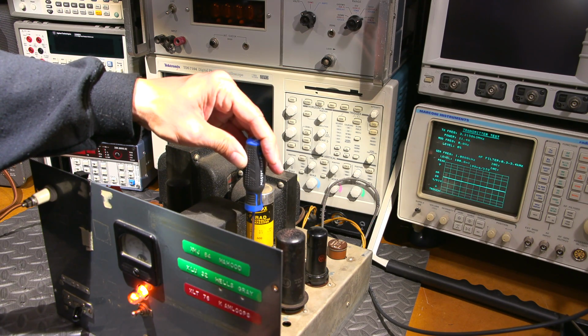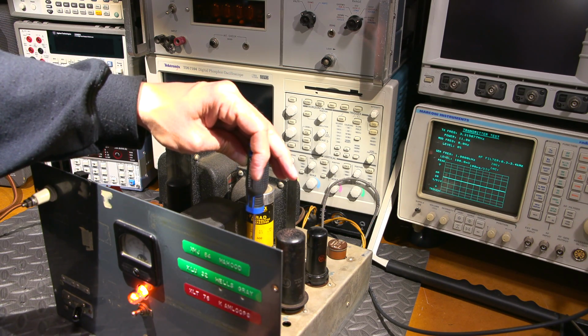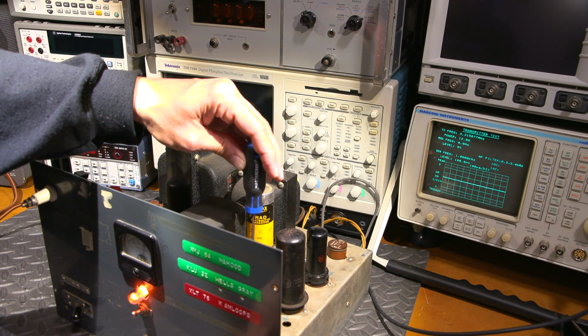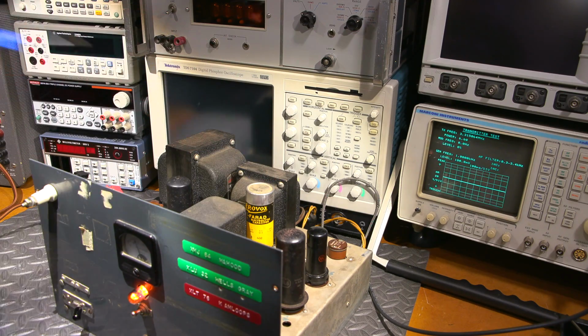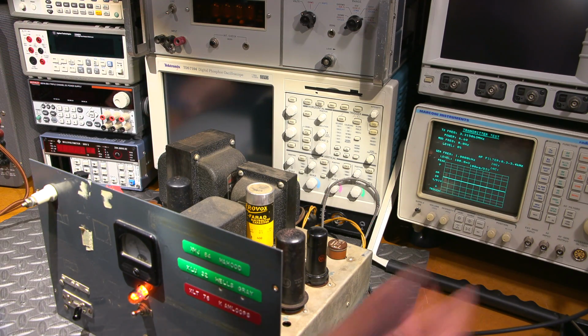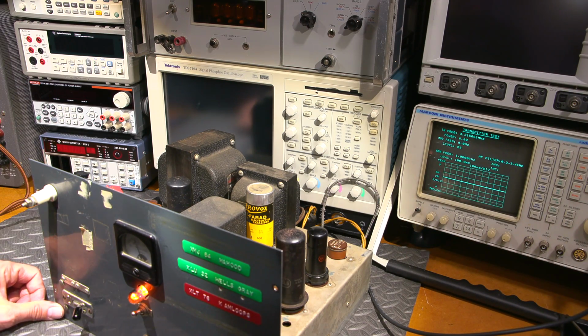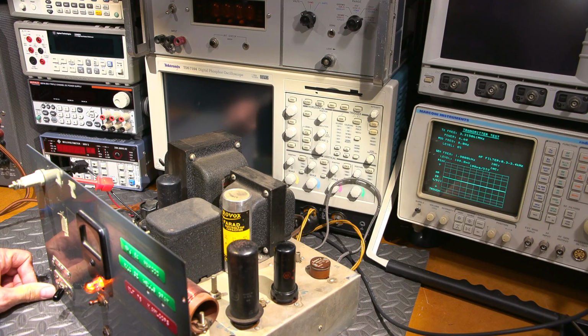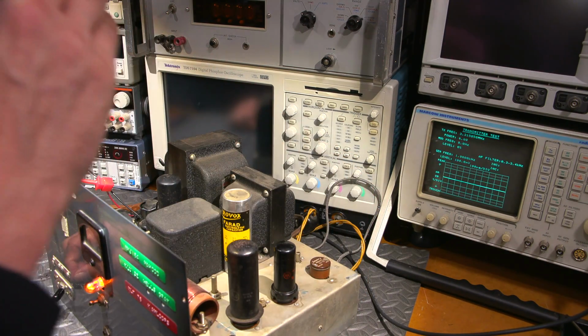I'll bring this out of the dip, and let's move this around just a touch. Yeah, out of the dip, we can get about 12 watts. It's flickering about 12 watts completely with that one old 6L6 there. So I'll just leave it there. Not much of a difference. Again, it's into a non-inductive load, right? So, with my slight bit of added reactance over here. Let's see, what else can I say?